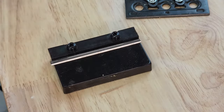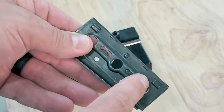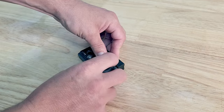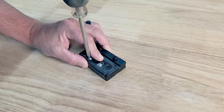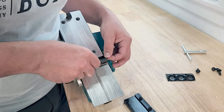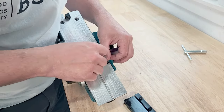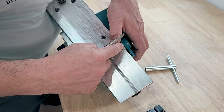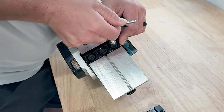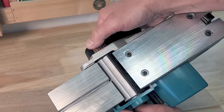Butt it up against the gauge plate. Now loosen the screws on the set plate. If you look at the back of the set plate, you'll notice features that hold the blade in place. Place those features on top of the blade and then push the adjustment heel in until it is against the back side of the gauge. Then tighten the screws. Now place the blade on the drum and then place the set plate on top of it. The heel should go into the groove on the drum. Now install the cover and loosely install the three bolts. Make sure the blade is properly seated in the features on the back of the set plate and that it is centered from side to side. Tighten the three bolts and then manually rotate the drum to make sure the blade clears the housing. Then just repeat on the other blade.